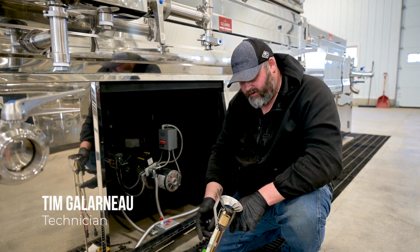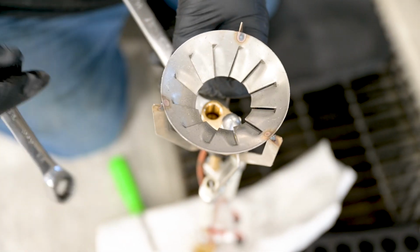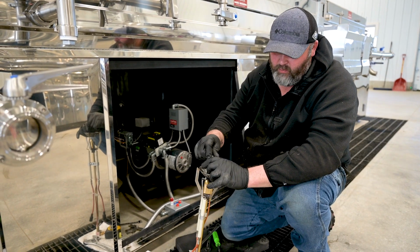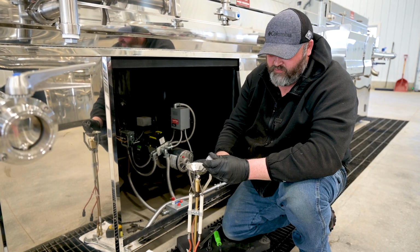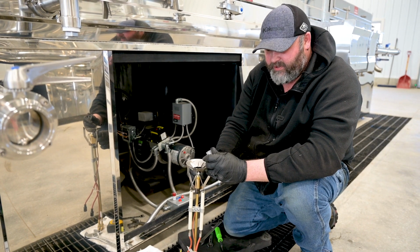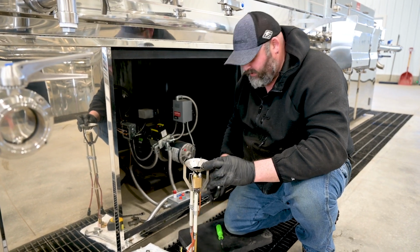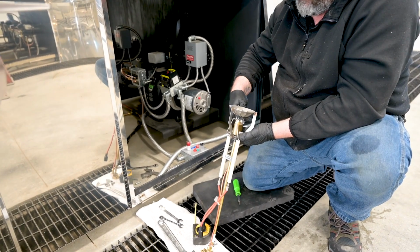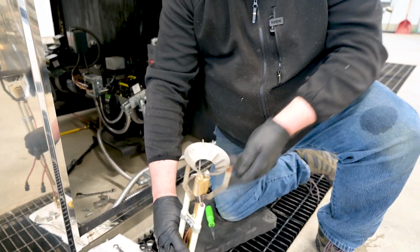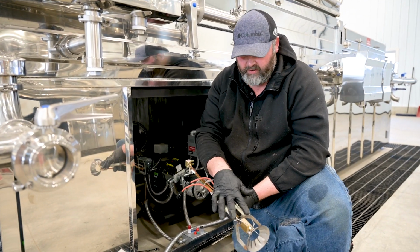We took out the retention head or combustion assembly, and we put in our low fire nozzle, adjusted the electrodes to the proper length for easy igniting, and now we're going to put in the high fire nozzle, which are all pre-selected based on the size of the rig and what you're doing for concentrate, and whether you have steamaways or preheaters and all of that. So there's our high fire. We just gotta tighten it in now. And that's basically it. 2 nozzles on this particular burner, igniters.